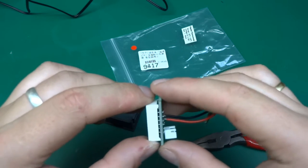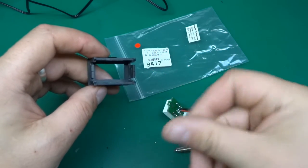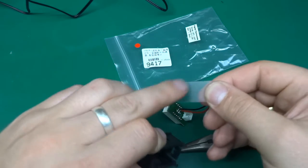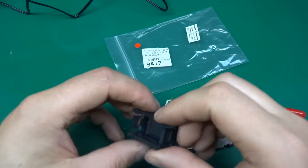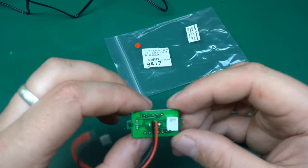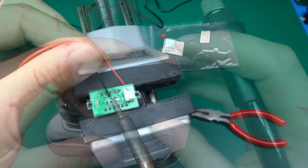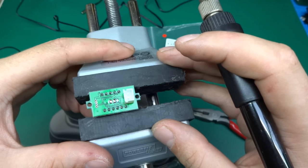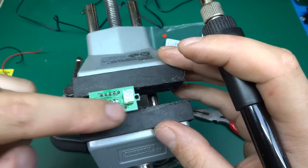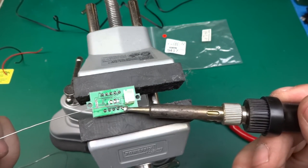We will not be able to see what chip is underneath — how disappointing. We've got a little diffuser; the smooth side should be on the inside and the porous side on the outside. I'm a little annoyed I can't take it apart further. I think the best approach will be to flood all the pins with solder and heat it up evenly and pull the whole thing out.